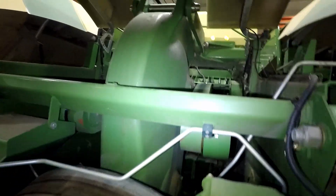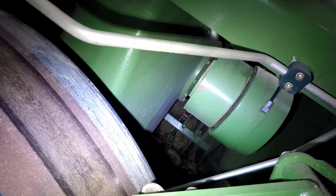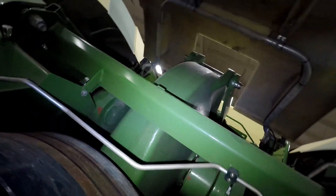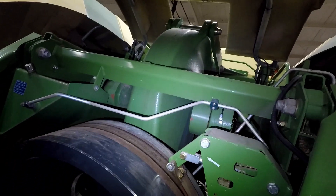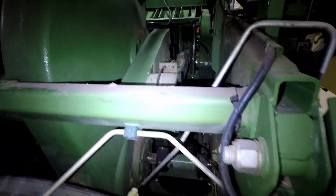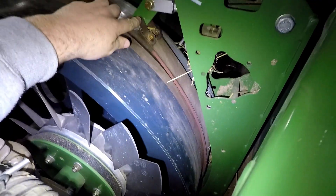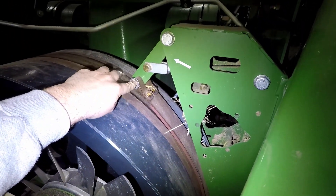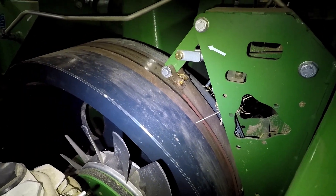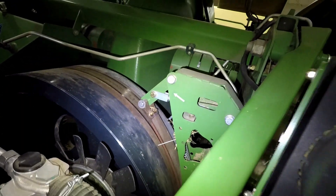Just to maintain some of the critical oil components. Looking up here, that is our main gearbox. Right here is our main arm. It's actually in the back stroke right now, so if we had this hooked up, we could see it stroking in there a little more. This component right here is actually our flywheel brake. It is literally just going to stop this thing, so if you ever go to service it, you can lock that thing in place just for your safety.